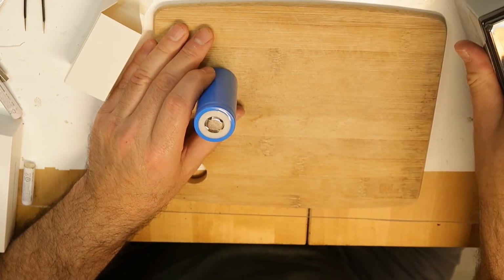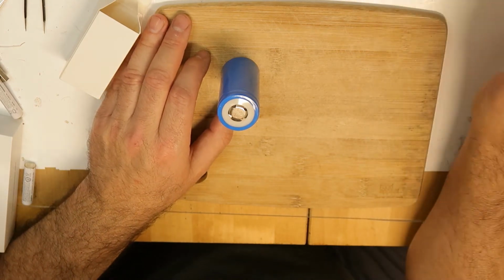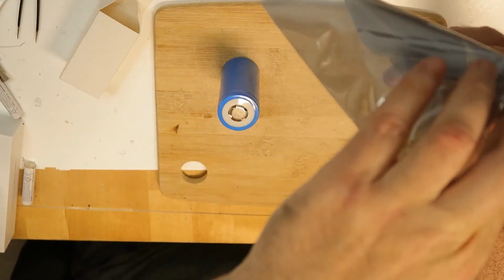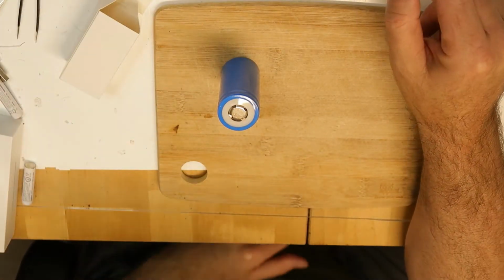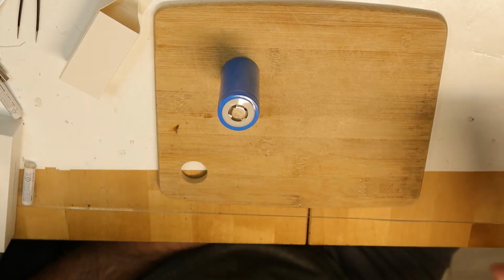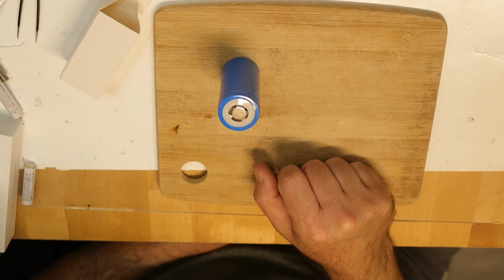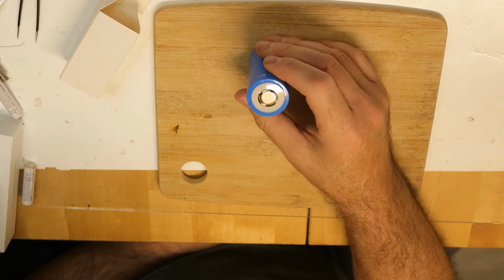So, in order to build it, I also need a BMS that is capable of this high power. So I have something here, not this. I found, I will show later, a BMS that is capable of 60 amps continuously, and I will use it with the cells. So this should solve the whole problem, and then we will test if this is really working with this change.